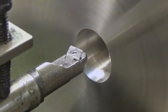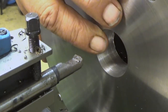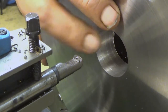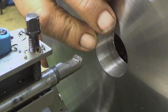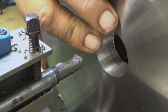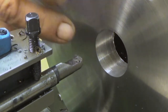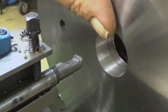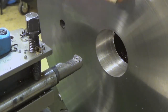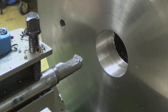Until we reach something like 35 millimeters in diameter. Well, we are at the moment, this is now 35 millimeters. And well, this is not exact science, it's about 35 millimeters. And now I will take first a 0.9 millimeter cut, and then I will make a better surface finish here by making a 0.1 millimeter cut with very slow feed. Yeah, so let's take the 0.9 millimeters first.